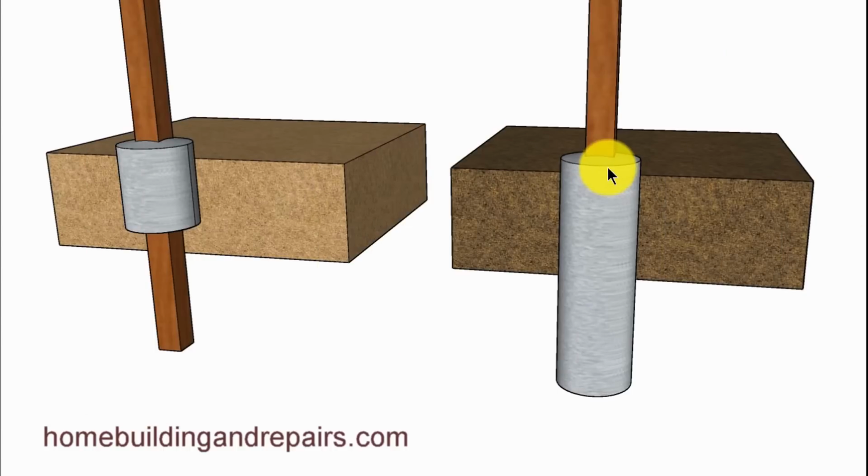Now, should you extend the wood post into the ground and then encase it with concrete, or can you just have a small footing like this and then have the fence post go into the ground, to get a little more stability? Now, for something like this in sand where the water is well drained, this might work. In clay, I wouldn't do something like this. The bottom is either going to rot and then rot its way up to the top, or absorb moisture into it and then wick it up to the top. It'll actually just work its way to the top if it's in the ground. So I think eventually this would rot. This wouldn't be good for clay. So in clay, you would need to do something like this. Sandy soil, something like this might be fine.